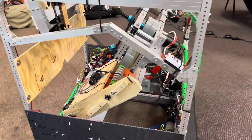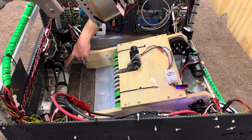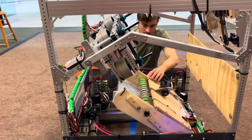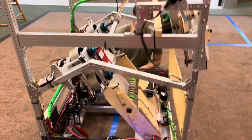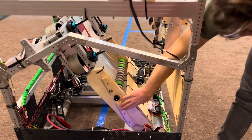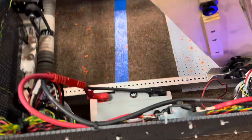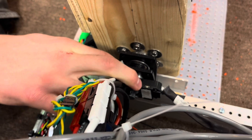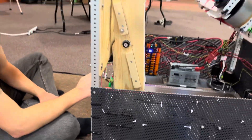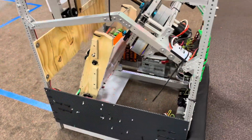Moving on down into the hopper — that's what we are calling this mechanism right here — this collects it from these intake wheels here, and then, if we can move it up, it feeds it into our next two manipulators. One thing I decided to go with as a design was this ledge here. This makes it so that it mechanically stops on those chassis rails and does not touch the floor. We do have an encoder on here. We don't have software up yet for set positions on the other two mechanisms, but it's there if and when we use it. So that's our hopper.